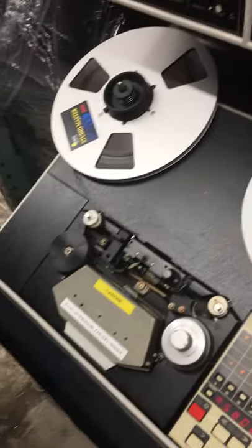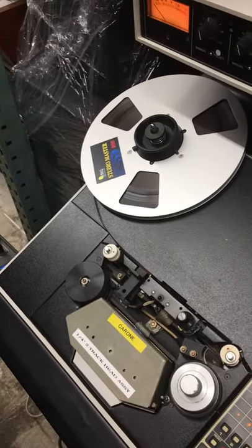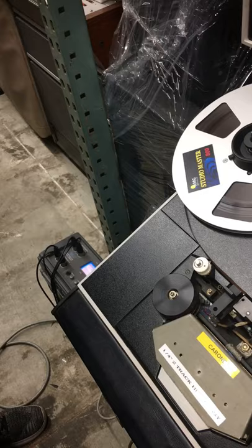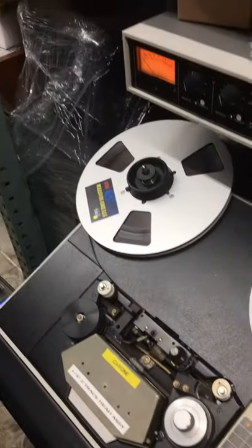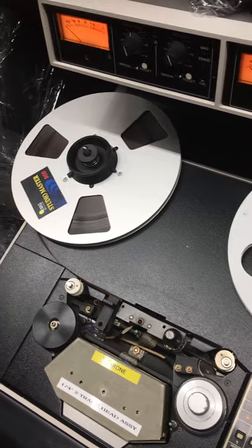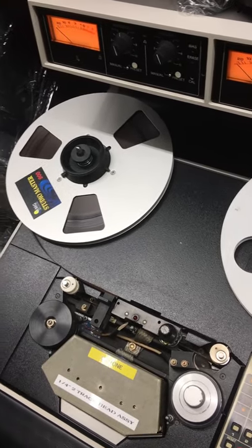I could make it go faster if you want. It does get way up there. Are the gyros in here? Yeah, sintered. The highest I ever saw was 43,000 RPM. Don't want to be anywhere near it. We're not going this fast. Are these stepper motors in here? No, those are DC motors. What do they call that? Squirrel cage or something. I can't remember the actual term, but they have brushes and a commutator and magnets.